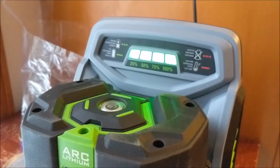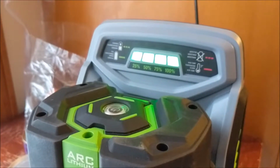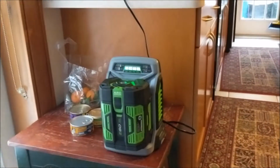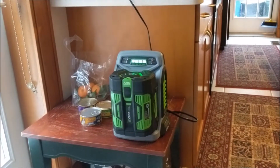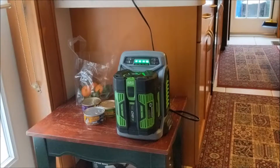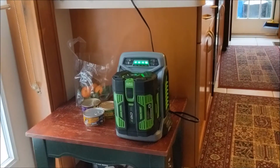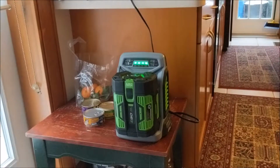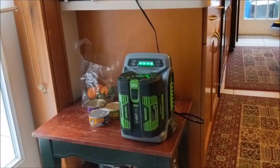This type of charging, where you let it sit near fully charged for the charger to balance the cells, is important to let happen every now and then, every few charges at least, to give the charger a chance to balance the cells to the same exact voltage. This will give you a consistent and best capacity for your battery and prevent the chance for imbalance of the cells, which may lead eventually to damage to even individual cells.